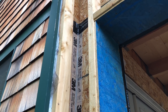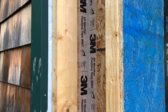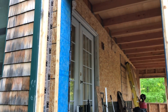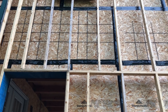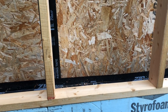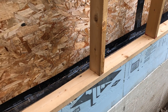Here I have a tape joint in between the new wall and the existing wall. In this case, I'm using 3M8067 flashing tape. The only reason for that was because when I did that, it was about 20 degrees, and the other tapes I had would not function in the cold. That tape performed amazing in the cold — it stayed nice and pliable and sticky. If you're doing a double wall construction, you also want to tape your wall down to your OSB subfloor.